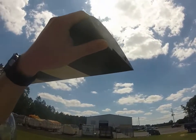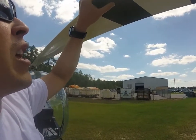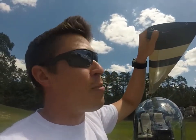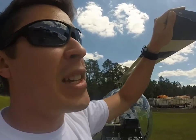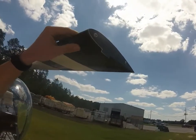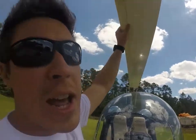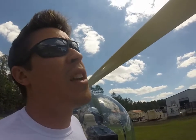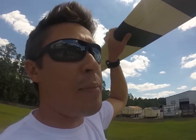What I am looking for in the blades is obviously the blade tape. With these blades, you generally do not want to fly without blade tape. If you run into conditions such as dust or water and you are rotating at 400 plus RPM, it tends to wear out the surface area. You will also have blades that don't have blade tape on the far corner, and you will get premature wear there, so always make sure that is checked. We are also checking the general condition — clean blades perform better than dirty ones. Make sure there are no cracks, and if you have blade tape cuts or tears, go ahead and remove that so it doesn't peel off while flying.